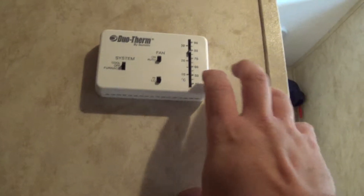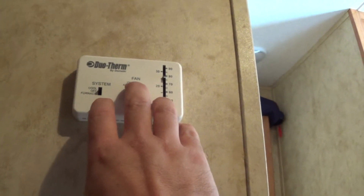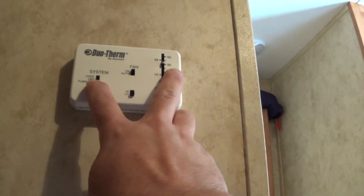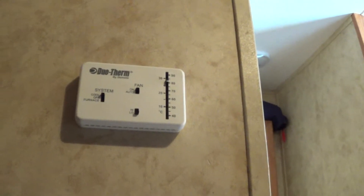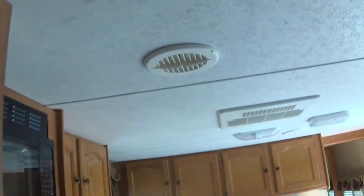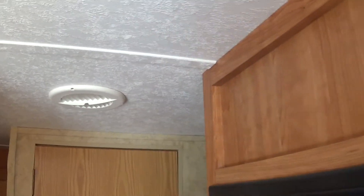I can't resist the temptation — I'm going to see if I can run my air conditioner. 13,000 BTU should be well under the range of the 4,000-watt inverter. I'm going to start the fan on first to handle that surge, and then go ahead and hit the air conditioner. It's running! I'm running my air conditioner off of batteries. Pretty sweet. I don't know if you can hear that running, but yeah, it's blowing a little cold air out of there.